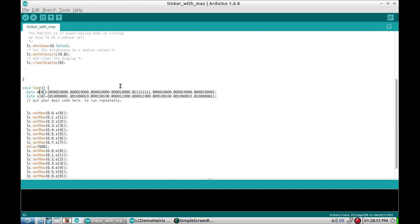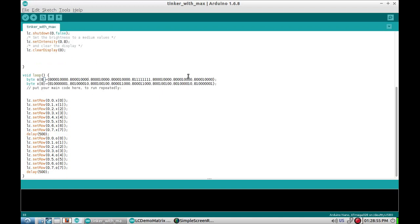I created two eight-dot-wide by eight-rows-high patterns - just the X and the plus. I labeled them X and O just because that makes complete sense since I made an X and a plus. The first chunk does the X - just the bits you'd see. Eight bits: the first column gets a one, all middle columns get a zero - that's the top row. Next row down the one moves in, next row down the one moves in, the ones meet in the middle pair, and then back out again. Wait half a second, and then the O which is the plus sign.